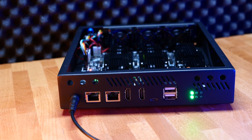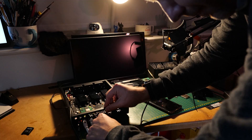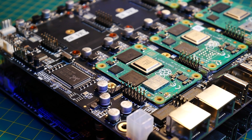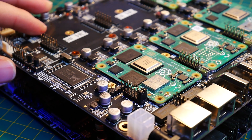The IO is also present, though with some limitations. There are two USB 2.0 ports and two full HDMI ports, but they are only connected to the Compute Module installed in slot one. This lets you maintain and manage your cluster without doing it headlessly — just plug in your keyboard and monitor. The IO also includes a dedicated power socket for a PC-style power supply, handy if you're building your own case. There are three four-pin fan connectors, though the supplied enclosure fans only have two pins, which removes PWM control. Each CM4 slot has an exposed GPIO header and a micro USB port for flashing the operating system.